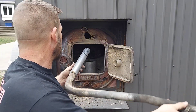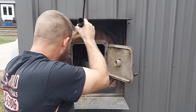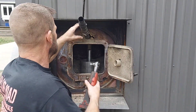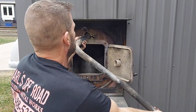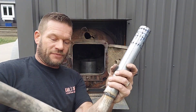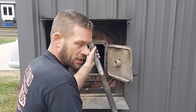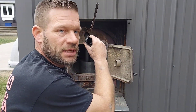Anyways, we're gonna get it in the boiler — it's fairly simple. Just get it centered in that oblong burn pot as good as we can. I just have a radiator clamp here to hold the nozzle. I never showed you the bottom — here's how I put my feed line. You can see my feed line here; it runs all the way through the middle of this pipe. I actually have to cut it to get the 90 through there, but the bottom oil feed line is directly in the middle — it's just floating in there.